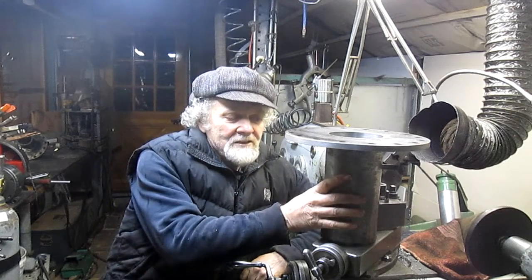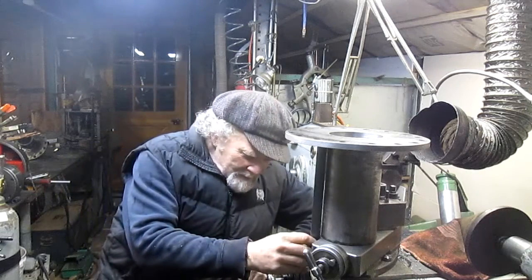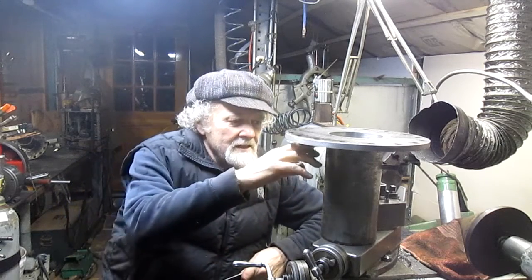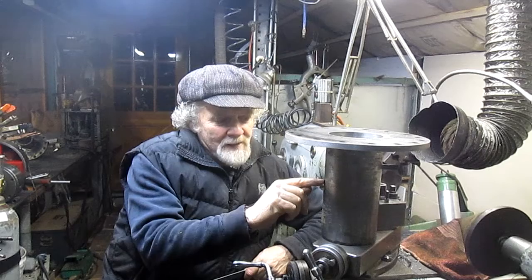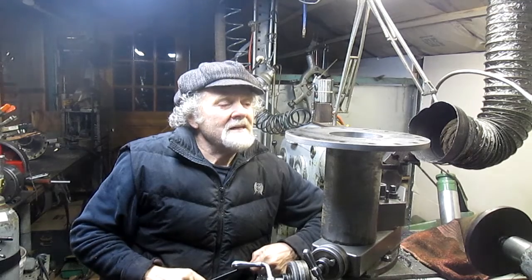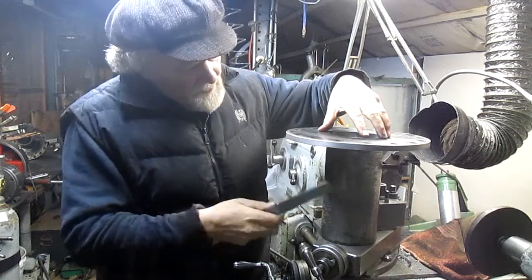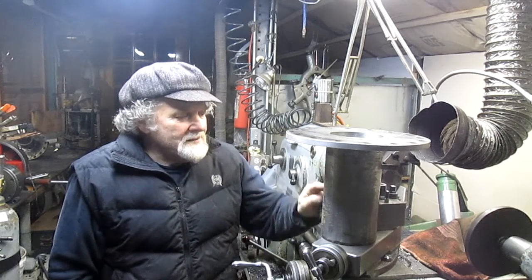Well, good morning, Nick Collier here again, and today I cut the tube to length, and I believe, I can't remember what the length was, 11 inches, something like that, 9 inches. Yes, 9 inches from here to here, and what we have to do is get this plate to slide down to about halfway. And we'll take a more accurate measurement later on. But for the moment, we're sitting at about a good eighth of an inch larger tube than the hole in the plate. And so we need to trim that down.